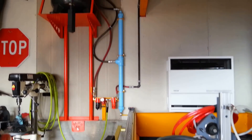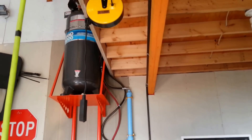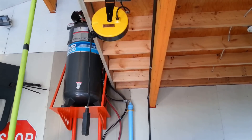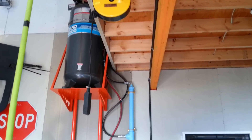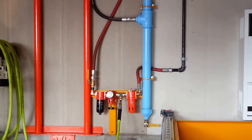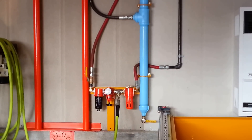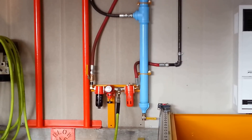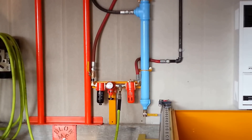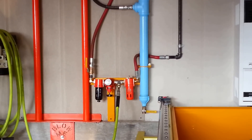The compressed air exits much drier from the top fitting, and from there it goes into the reservoir, the pressure tank for the compressor. When we call for air, it exits from the compressor main tank through the red line into my air system right here — an air filter on the left and an oiler on the right. The regulator is in the middle. I'm running high pressure, maybe 125 psi, through the regulator. The lime color T just to the right of the regulator is dried air but un-oiled.